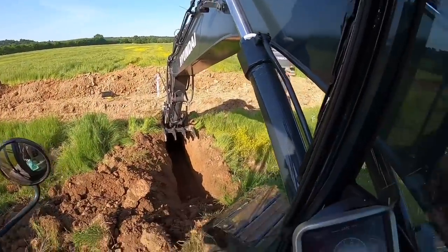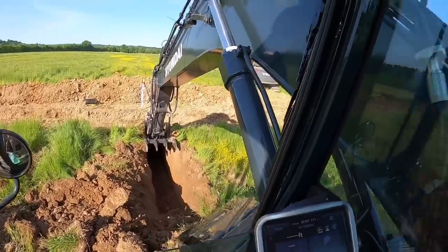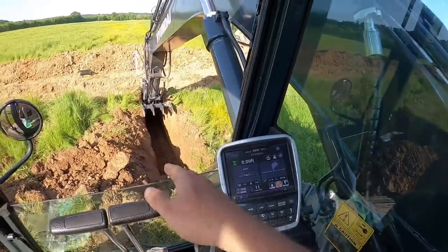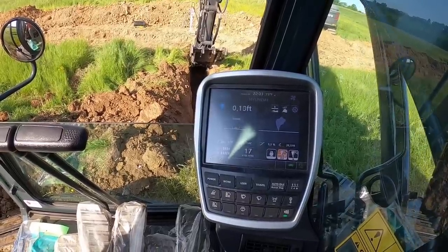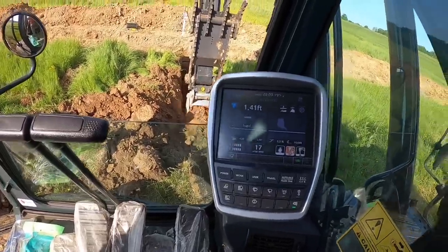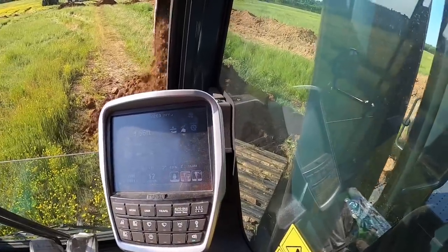Digging this mainline ditch using the guidance control on the machine — I wasn't 100% sold on it. Of course, we were asking a lot out of it trying to be pretty precise. But this is where it's proved to be extremely handy. I got my teeth set around the bottom of that other ditch. I'm going to dig this start hole out — I just want to make sure this start hole comes up, even two or four inches, it just needs to make sure it comes up. As I come back, as long as that number is climbing and not going down, we're coming up. Some of these start holes are pretty short, but this one is actually going to be about 30 feet long because it has to go all the way over to the backside of this road. Before we would have set the laser up just to do this, but I'm confident enough in that guidance control — definitely proved to be pretty handy.